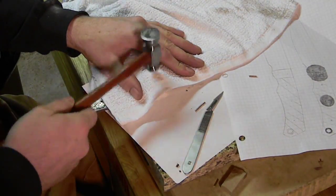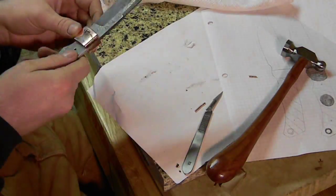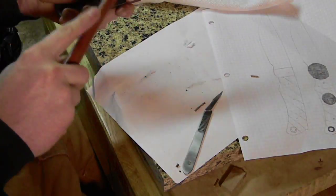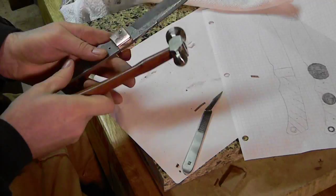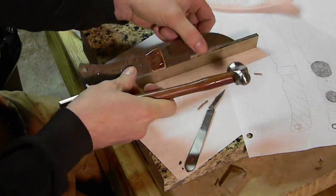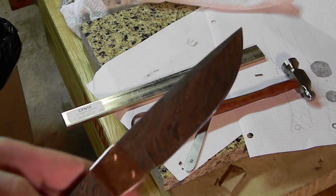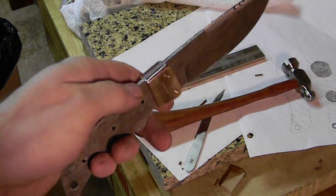And when you start buffing wood and things like that, you need to be going at a slower speed. Otherwise, the friction will start to create too much heat and you'll burn your wood. You'll actually put char marks or burn marks or something on your wood. So, the one I have for buffing runs at a little bit over 1700 RPMs.